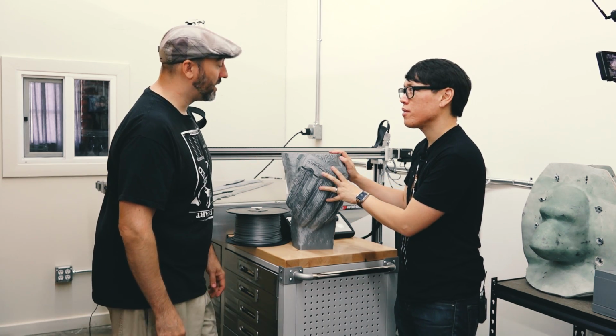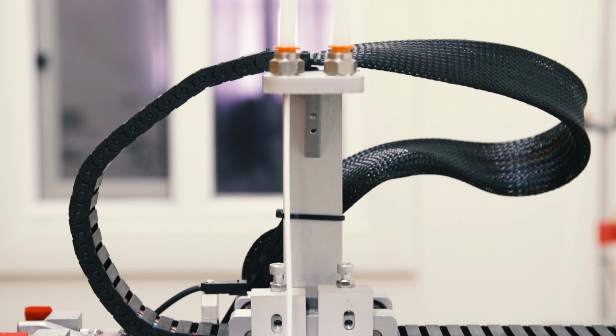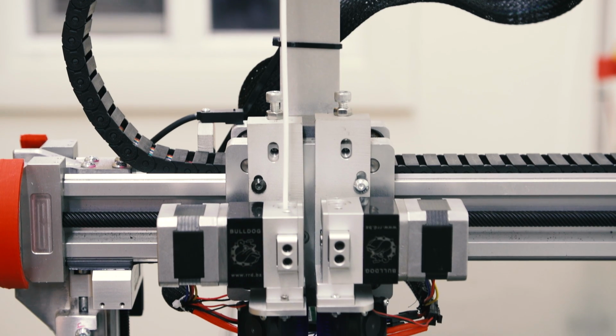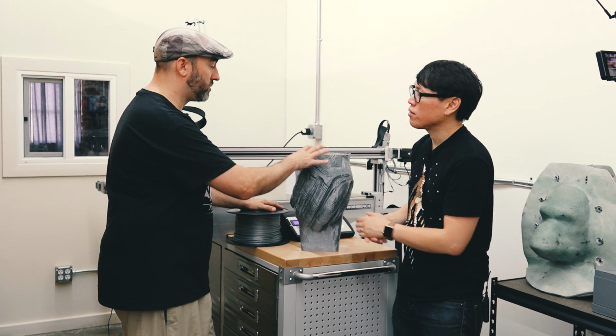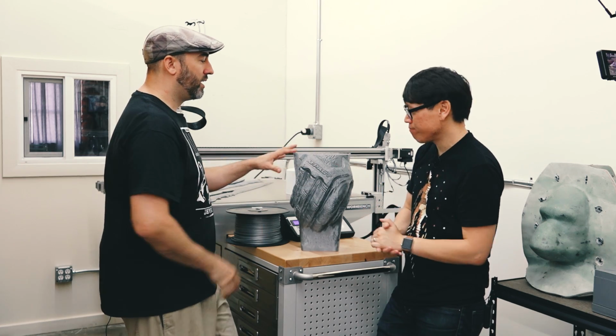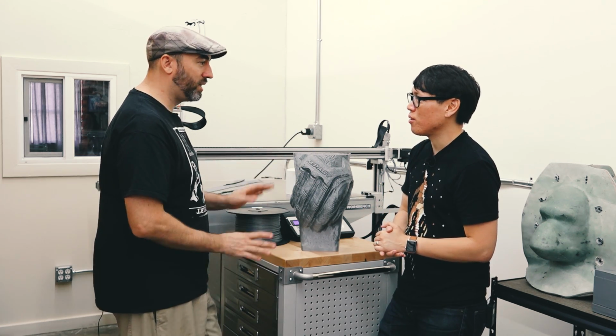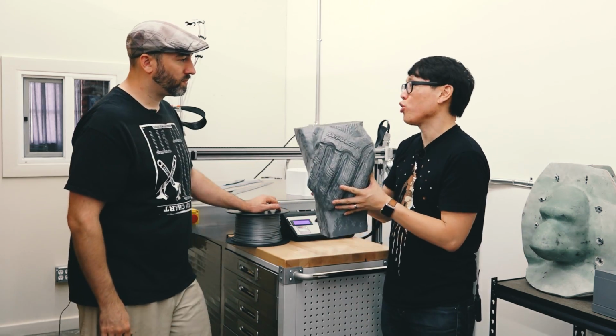And this is PLA? Yes. I've almost only been playing with PLA just because it's kind of easy. So something like this is printed out. Do you then do a finish pass on this, or do you print out your finished products? Well, when we did the final one of this, we ended up just coating it with XTC, the Smooth-On. It's like an epoxy, and then painting it, and then it was done. We really didn't have to do anything else beyond that. So that was really nice. It didn't need to be super high fidelity, high detailed. Nothing was super polished with fine, smooth surfaces. So it was easy.